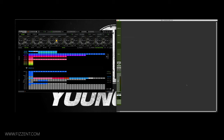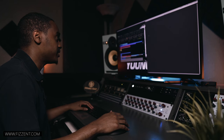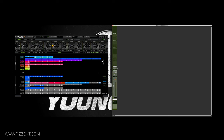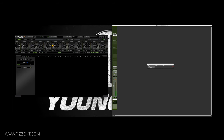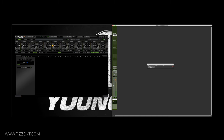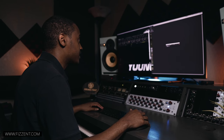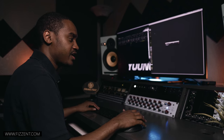Testing: I add an AFX insert and check the meters — signal is coming through on AFX and in the effects panel it's confirmed there too. Next I test the 542s. The Mono Gamma doesn't have meters, but on the 542 I see green on the first channel. Channel 6 shows nothing, so I need to troubleshoot.